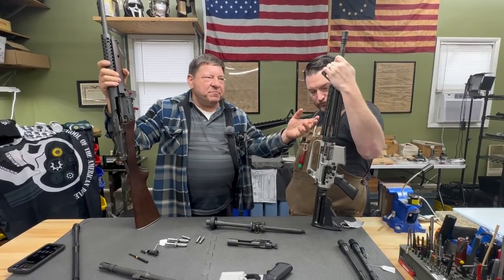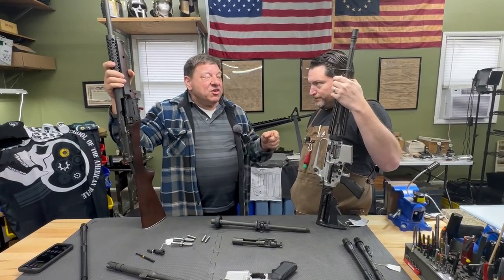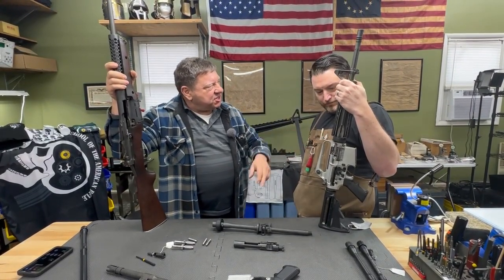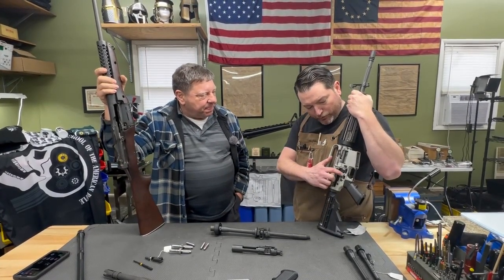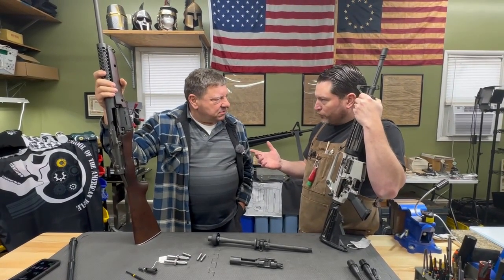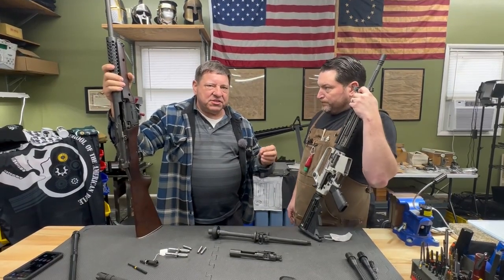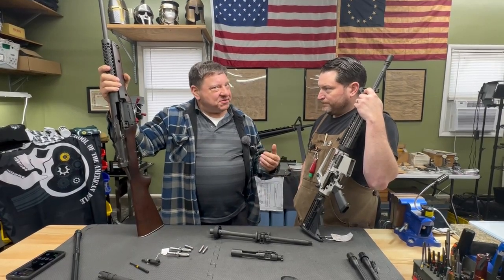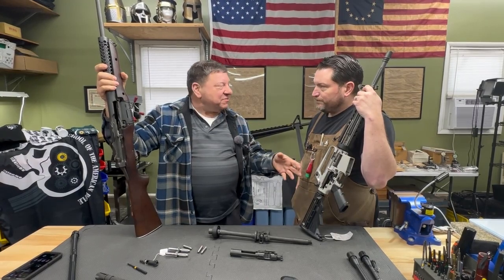So what happens when you get a gun with a steel barrel and an aluminum receiver, if you get that wet, you will get corrosion around the head. You were telling me at lunch today that you've actually seen delta rings break torque because of that. Yep. I've seen hammer and trigger pins get looser because they were run dry. You had mentioned aluminum oxide. Aluminum oxide takes up more space than aluminum does, so it tends to jack itself in the hole. But if you do have motion, aluminum oxide is also sandpaper. So you've got a bit of a lapping going on there.